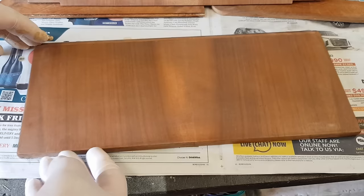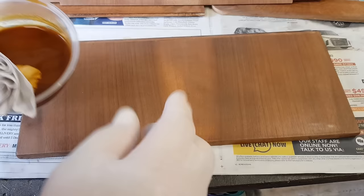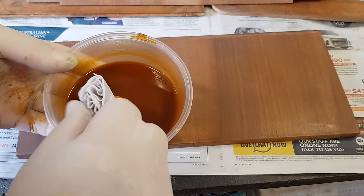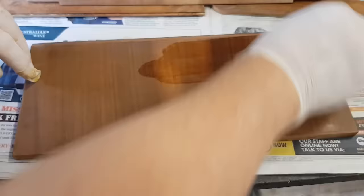The case is very well made but you can see they've sanded through the edge there — that's about the only defect. This is the door or flap that covers the dial and I'm going to treat it a little bit differently this time. I've been talking to a guy named Pete who's a furniture refinisher. He said to use a 50-50 shellac and methylated spirits mixture and put it on as a wash coat — put that on first, then stain it, then put your finishes on. And if you don't like it you can wash it off with methylated spirits.